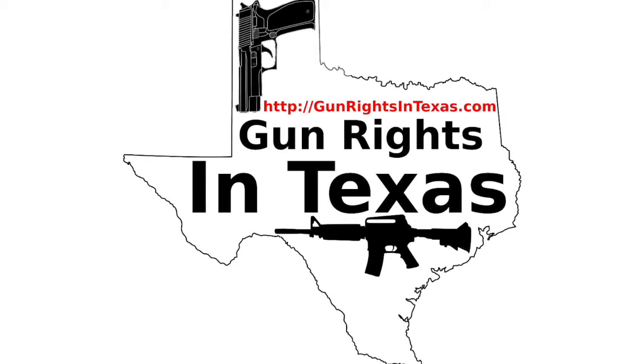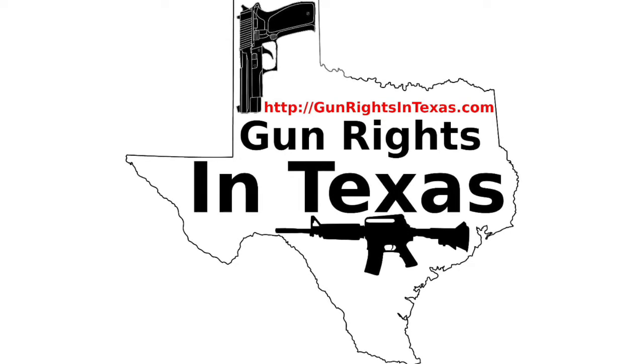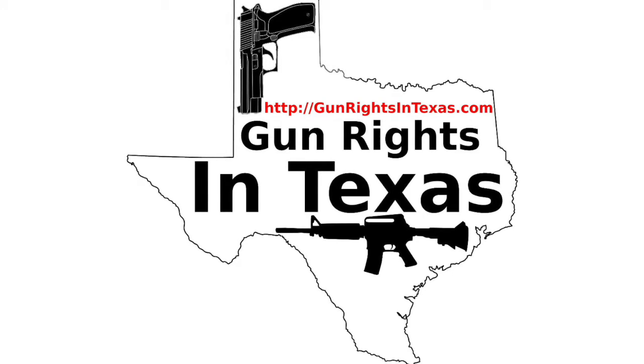I have a lot of brass that I have no idea how many times it's been shot when it comes to .45 auto, and I want to know what kind of shape it's in. When I look at my brass, it's a lot easier to see a defect if there's no grime and residue and soot on it. I'm able to look at the primer pocket. I found a couple of deformed primer pockets the other day — it looked like they'd been punched two or three times when they punched the flash hole. I had never noticed it before, but with the clean brass, I actually noticed it.